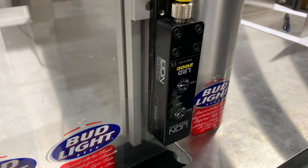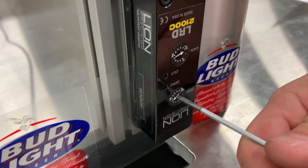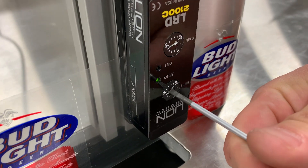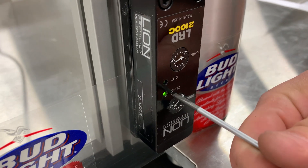To train the sensor over the liner, we're going to first adjust the gain to the max at 100, and then we're going to adjust the zero to make it go into that transition period where it's going on and off.